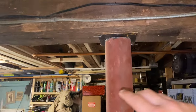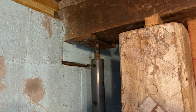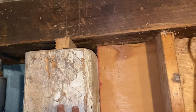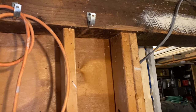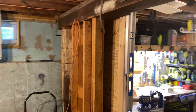Right now I'm basically going to take a lolly column like this and put it right here to replace this. And then over here I'm just going to fill this in with mortar, and then put a couple of 2x8s and support it down to here. When I did all of this, I ended up taking all the weight off of here — that's doing nothing, and this wall can actually come right out. So eventually when I move my workbench, I can open this right up and have from here to here all open, which would be nice.